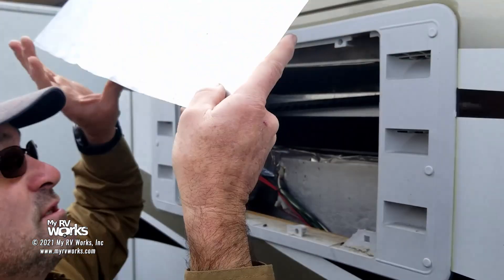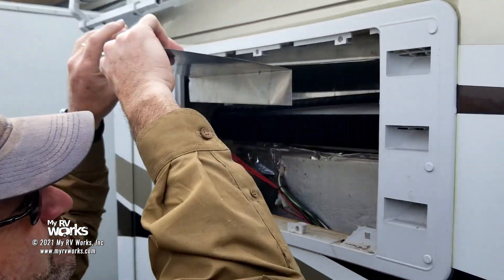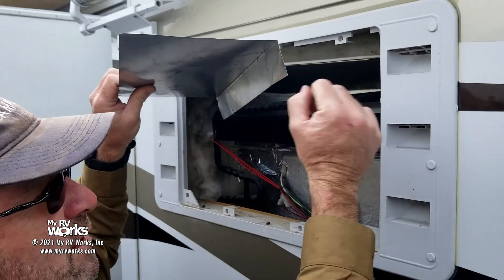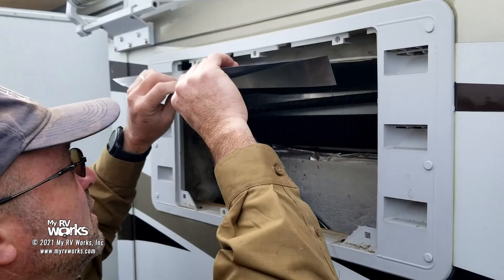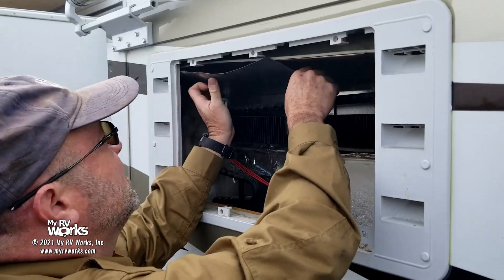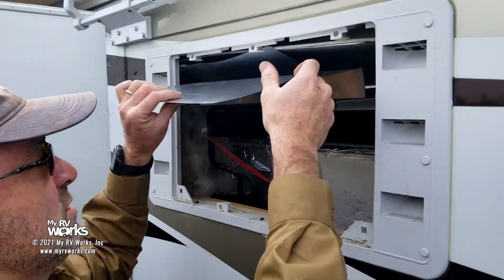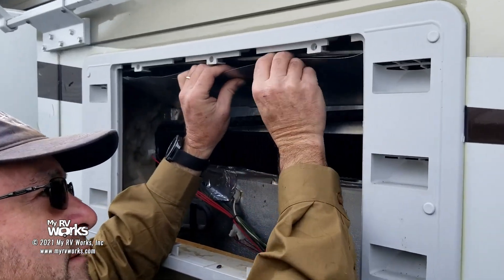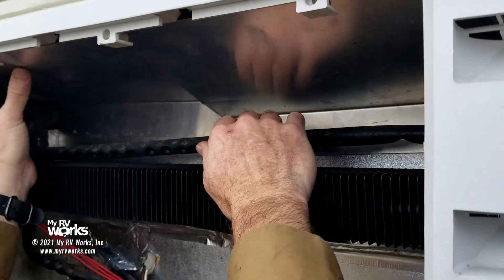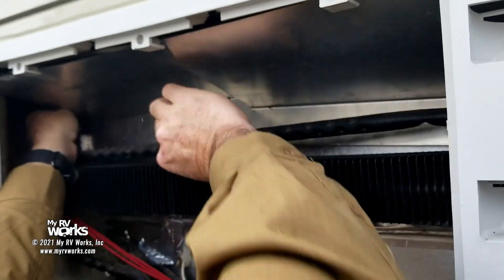We started to cut some flashing — this is just chimney flashing, get it at the hardware store. Go to Harbor Freight, get yourself a press brake to bend it. We're going to basically be putting one piece here and another one here. It was long so we basically cut it in half. I'm going to give you some camera closeups. We're going to make it pretty when we're all done, but I just want to conceptually show you what we're doing. We've had questions from folks asking how to do this.